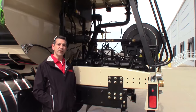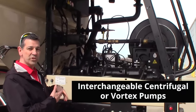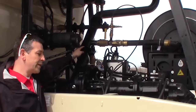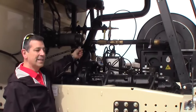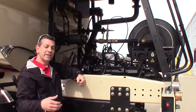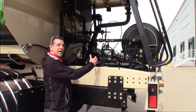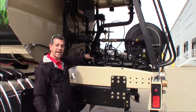We have built in the ability to easily swap from a centrifugal to a vortex pump. On this machine, you only need to remove bolts at a couple of points, remove a victaulic coupling, put a chain and hook on the assembly, and the whole assembly will come out and a new one can easily go back in. We have built it so that the centrifugal pump and the vortex pump accommodate the same footprint — the only difference being the actual pump itself.